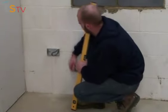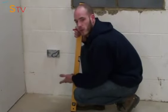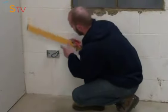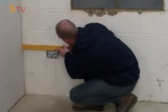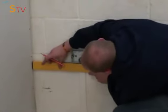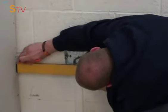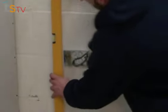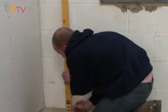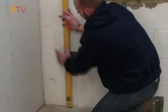So our PVA is dry now, but as you can see here we've got ourselves an electrical box. We need to cut around this — you can either do it before you put your boards on the wall, or do it once it's stuck. I prefer to do it once it's stuck because you get a better, cleaner line. So taking our spirit level, mark off each end, both top and bottom, then do the same for the sides and mark it on the floor. Remember when you're doing this, make sure you come out enough because when our plasterboard goes on you might lose the lines.